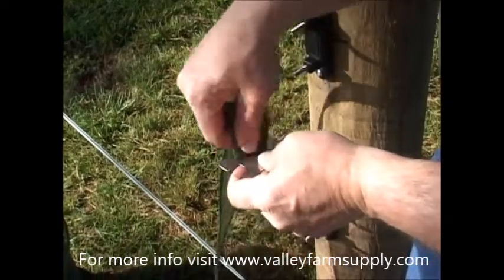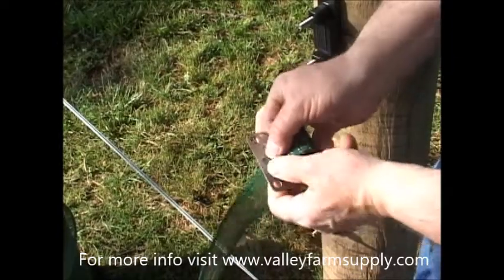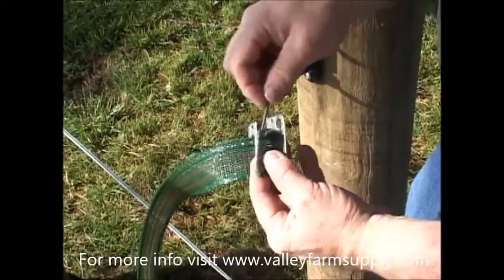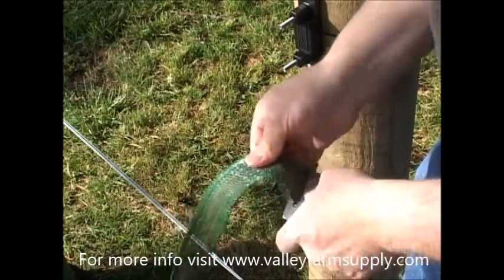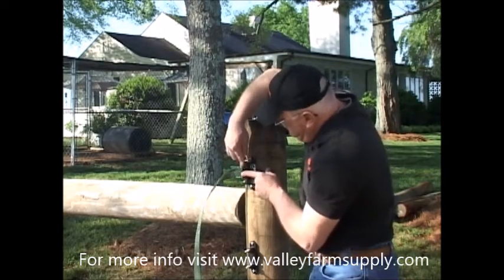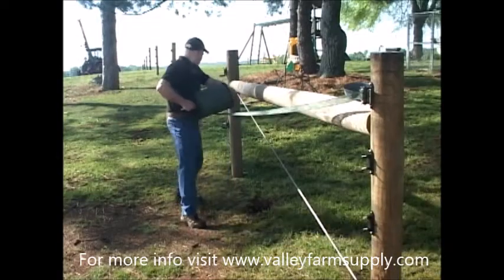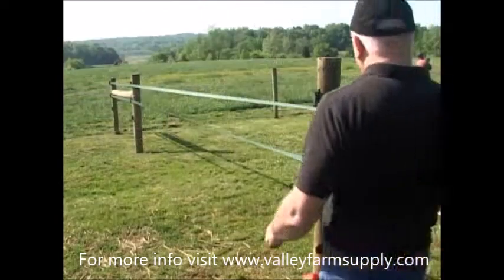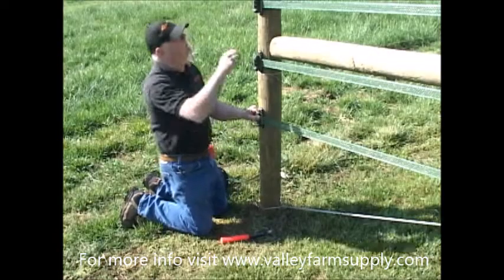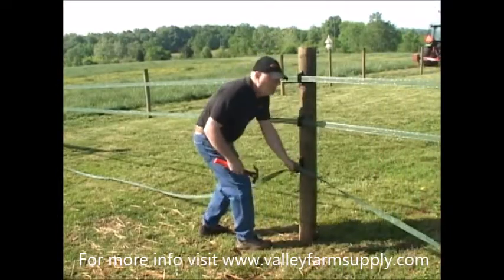Place through the bottom slot of the plate without the three holes. Then roll the tape over, inserting in the slot nearest the three holes. Insert the keeper pin into the keeper hole, then pull back and secure the tape. When correctly installed, the plate should not be able to move. Place the metal connecting plate in the insulator and reattach the outer plastic half. Finish by installing the stainless steel wing nuts snugly. Unroll the tape to the other end. Once this is complete, pull tension on the tape to make it tight. Then lock the insulator in place with a hammer. Apply tension on the opposing end post, fastening the tape with the same method as before. Repeat this process for each insulator on the post.